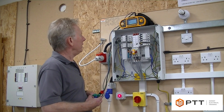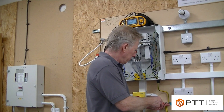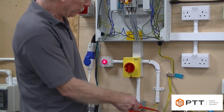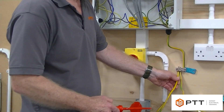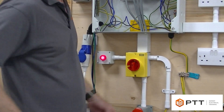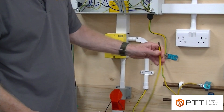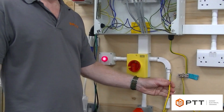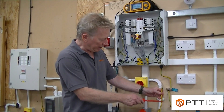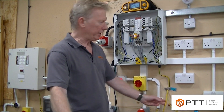The meter is in good condition and it's calibrated. The first thing I'm going to do is remove the incoming earth — on this particular rig it comes from outside and joins to the MET. It's no good taking off this earth here because I'd possibly be including some parallel paths. By taking this out, I'll isolate the earth, remove the parallel paths, and if there's any issue with continuity in this conductor, we'll pick it up at this stage.